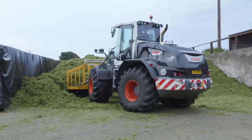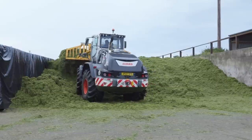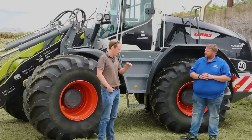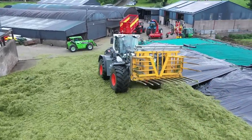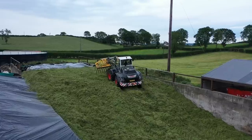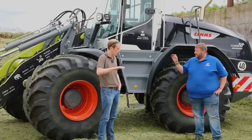Essentially you've got your six-cylinder horsepower — it's called the 1511P. The P stands for power. We have our standard 1511 with a six-cylinder engine at 188 horsepower, about half a ton heavier than this machine here. The 1511P is — steroids, yes, exactly. Lighter but jacked up: bigger drive pump, bigger hydraulic pump, more horsepower. So if you're ordering one for a quarry, you don't get the P. If you're ordering one to push grass, you get the P. The 1511 standard is still a really good performer, well able to push grass, but it's all moved up to that six-cylinder now.